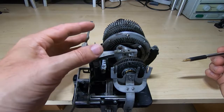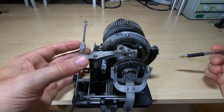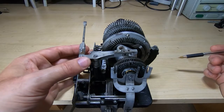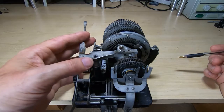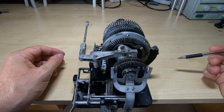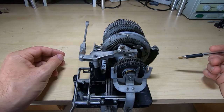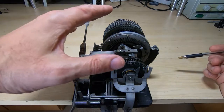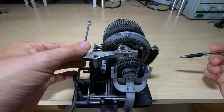That's it for this video. It's just a quick summation of how these two units work together. In the next video we'll look at what I think is the most interesting part of this machine. It's the control unit, and it controls the overall operation of the teleprinter. It's equivalent to the control matrix in a microprocessor, and as I say, it's by far the most interesting part of the machine, and I'll show how that fits into this arrangement and how it controls the teleprinter and decodes the various characters.